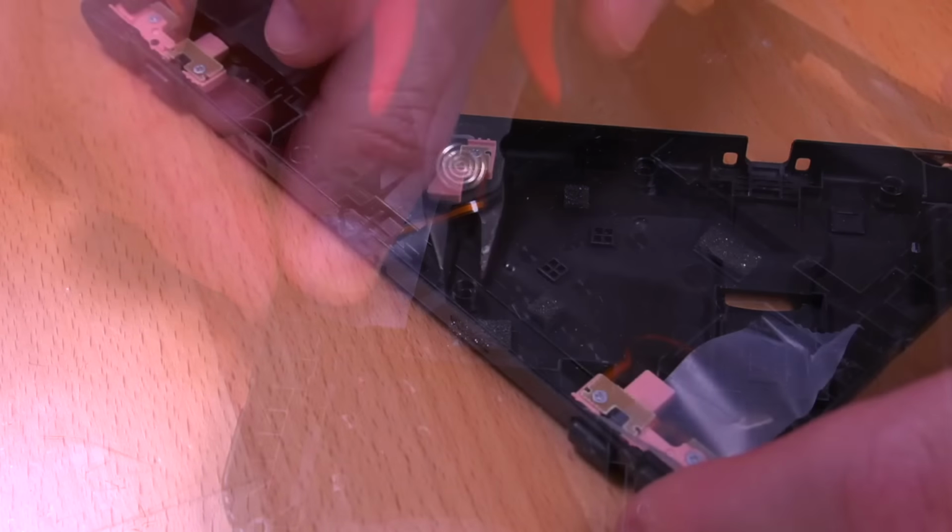After I felt comfortable with the amount that I trimmed, I then placed the capture board into the shell to mark where I'm going to create the opening for the USB-C port. Once I figured out where I was going to put it, I made 3 holes using my craft knife because I found that you have much better control than if you were to use a drill. With the 3 holes made, I cut them together to make a small horizontal slit.